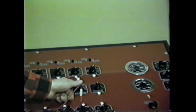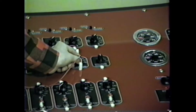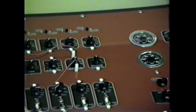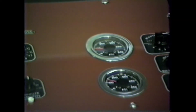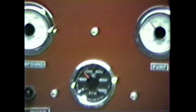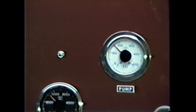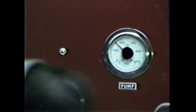If I was to suddenly change that elevation problem we had previously from 30 feet to 60 feet, you should get about a 15-pound decrease. It may be difficult to see, but there has been a decrease, and now we will have to increase his pressure 15 pounds to make up for that extra 30 feet of head loss we have.